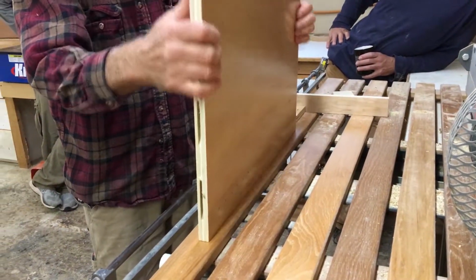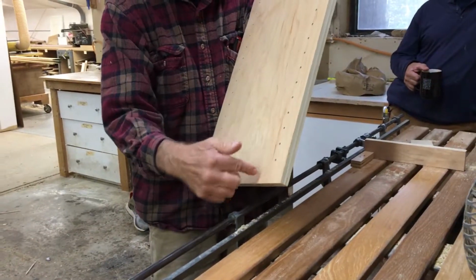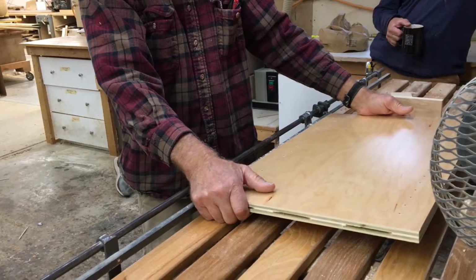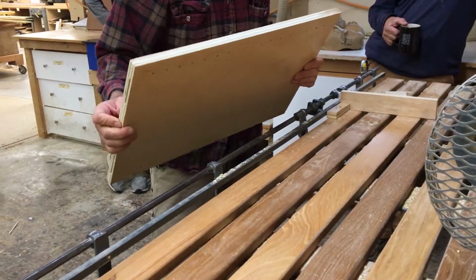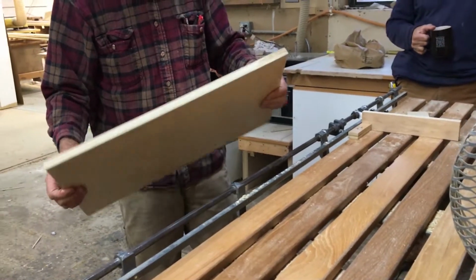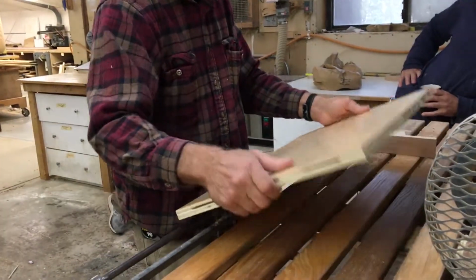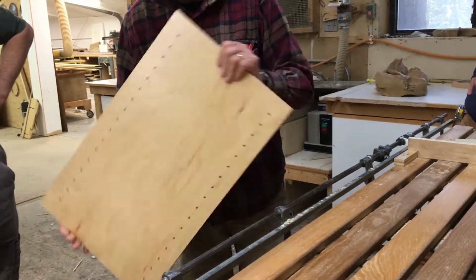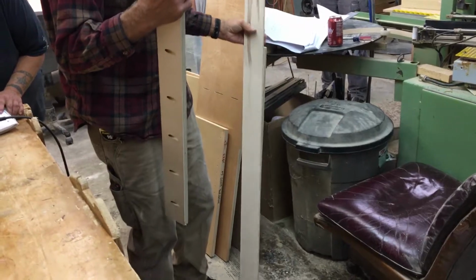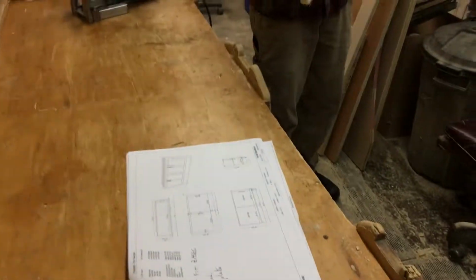1.5 inches or 1.25 inches? Well, I like 1.25, it's a standard, but when I have double side, I don't want to line them up. You don't want to be able to see through there. Yeah, you don't want to see through a hole, so I offset them on the other side. One side 1.25 inches, one side 1.5 inches. And of course, that one doesn't get any pockets because it's in the middle. The back one, we don't need to do anything to, but the front one, of course, we have to put pockets in for the face frame.